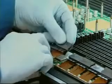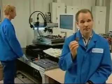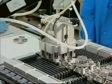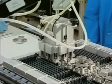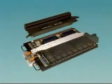After the surface mount technology is applied, we put the edge flex onto the printed circuit board — components very similar to previous products used here at Cray. The chip packaging and mechanical implementation of the SV-2 is key to getting the system to fit into its footprint. By using the multi-chip modules, we were able to get four processors on the same board, giving them access to shared memory in a very high bandwidth and low latency manner. This gives a single processing board the computational power of a full 32-processor Cray T90.